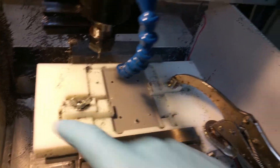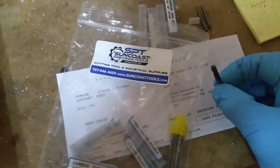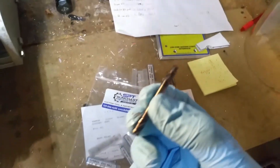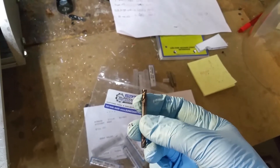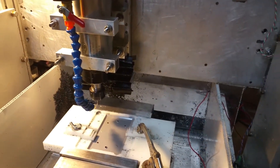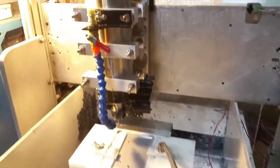The jig is made out of some kind of nylon that I found. The bit that I use is from Suncoast Precision Tools — they're on eBay and at suncoasttools.com. I buy these three-sixteenths TiAlN four-flute end mills. They usually last me through maybe a hundred plates, but sometimes I catch a burr and I just see the thing start to glow and I can hear it grinding. But that's worth it to me — maybe my G-code isn't proper.